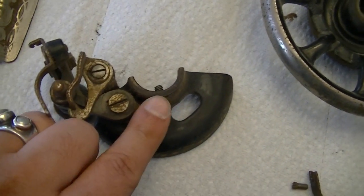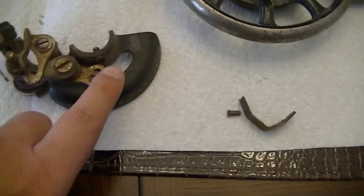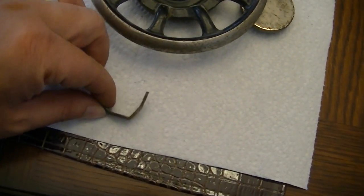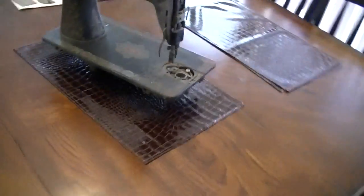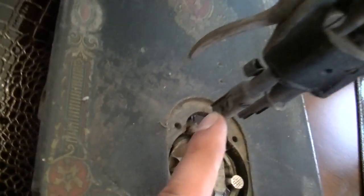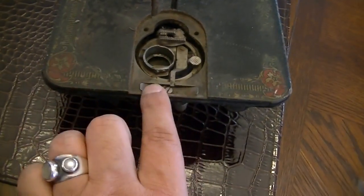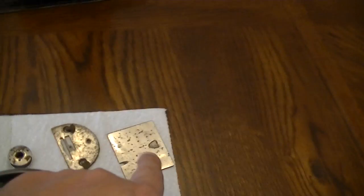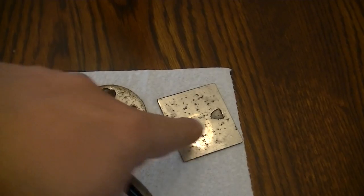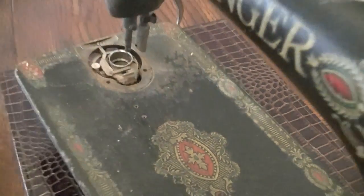Bobbin winder. There is this one screw. I just opened up this screw. Was not difficult at all. It was present here, so just open up this screw and this whole thing came out. This is the presser foot, and it was present here, so I just had to open up this one screw here and this thing dropped out. Just pulled out the cover plate, it stops here, just pull it out a little bit more and it comes out. Opened up these two screws and the back cover plate also opened up. So the back cover with both the screws came out, this came out, and the bobbin came out. I just had to press this lever and the bobbin was here, it came out.